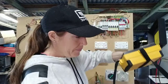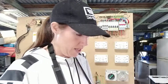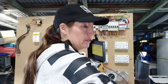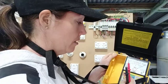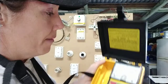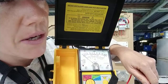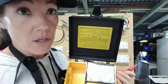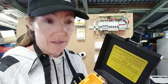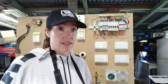Get your megger out. You should have one mega ohm resistor to use on the day to calibrate your machine. Switch it on, put it on to your installation mode — you want 500 volts. Make sure that you test your tester, it's working, and that when you test it it's actually on zero. If not, use the screwdriver to calibrate your machine, and make sure you're getting those readings when you test it.